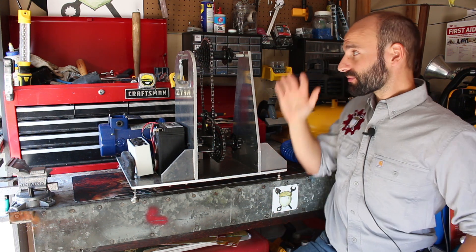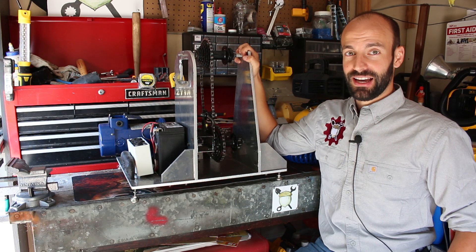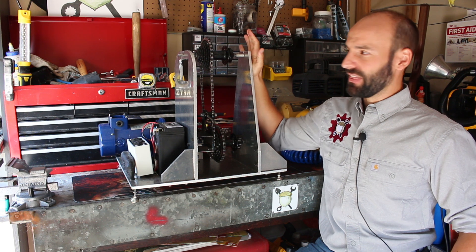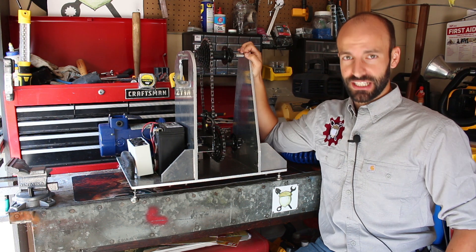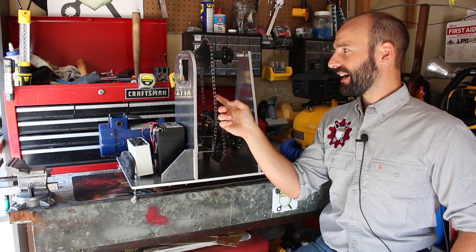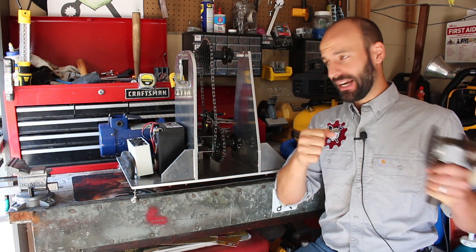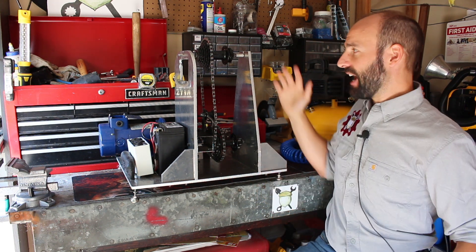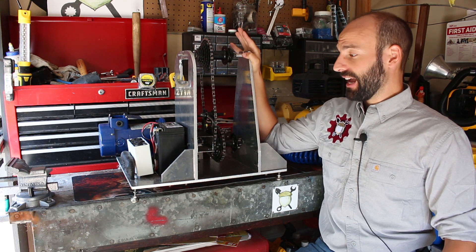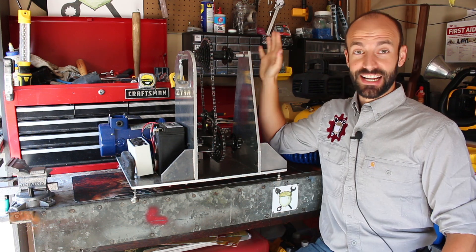For the fifth generation, I want to keep the structural integrity, robustness, and versatility of the fourth generation, but simplify the tooling changeover. When you swap out the chain, I don't want the whole wheel to come off and I don't want the whole axle to come out. I just want the bike to come in, you swap over a different chain, and the new chain drives the fifth generation generator. That would be a lot simpler, and with a simple changeover like that, if there's misalignment you can make simple adjustments.